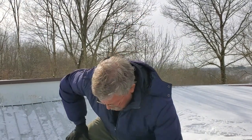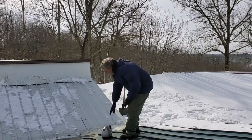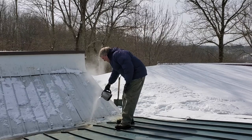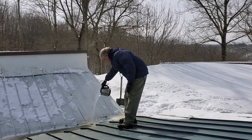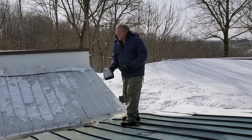So what we've had to do — if we didn't prepare for this today, it would be a real nightmare. What I've done is come up here and cleared out all of the ice, then I also take boiling water and try and go ahead and clear the drain. So that's going ahead and flowing through now, but that's because I prepared this a couple hours yesterday.